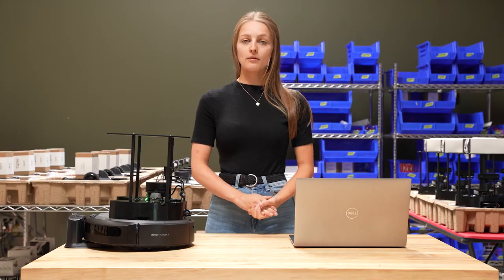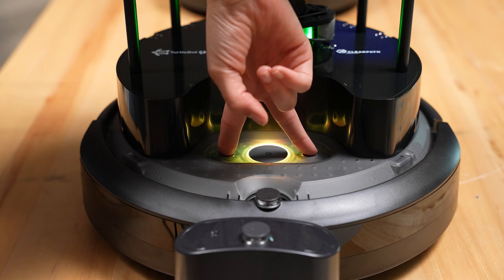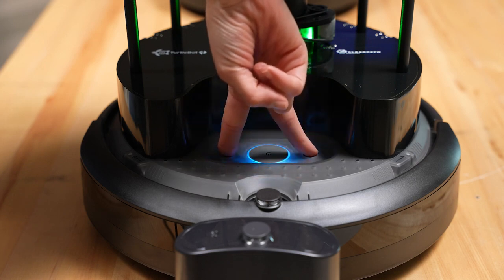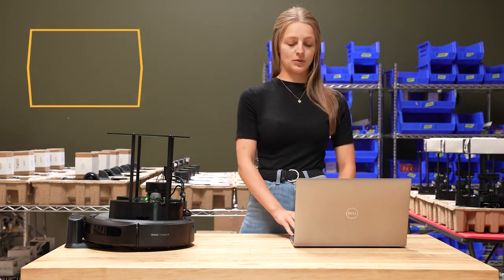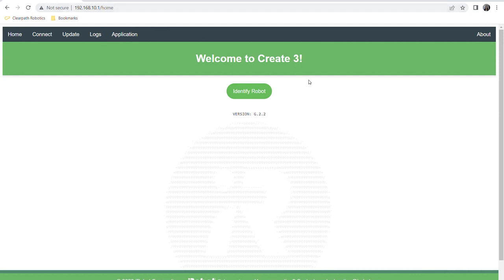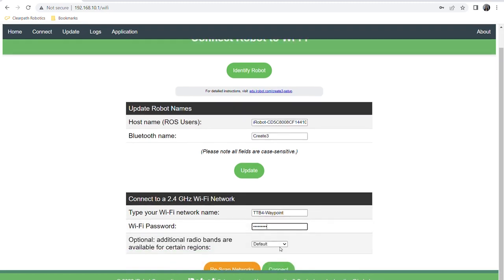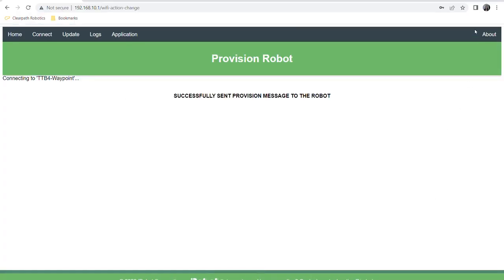Now that the Raspberry Pi is connected to Wi-Fi, we'll also connect the Create3 to Wi-Fi. Press and hold the small buttons on the front of the Create3 at the same time and wait until you hear a chiming noise and the light ring turns blue. Once that happens, connect to the Create3's Wi-Fi network in the format shown, then navigate to the IP address shown in your browser. On the Create3 website, go to the Connect tab, enter your Wi-Fi username and password, and click Connect. Once connected, the robot will play one final chime and we're all connected and ready to start driving.